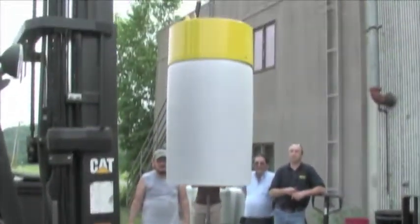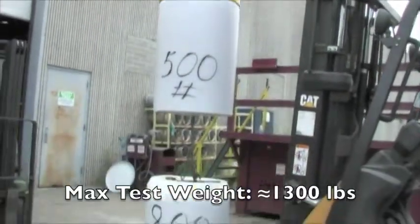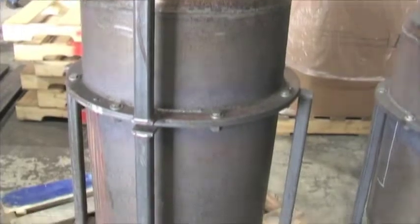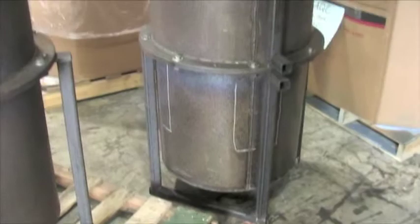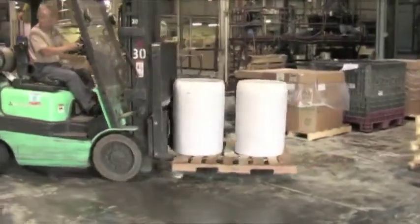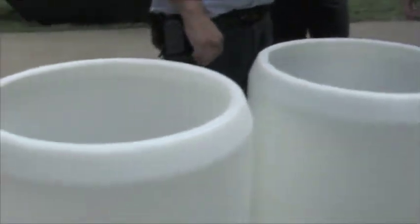In conclusion, we've completed all the testing and we're now prepared to deliver the product to the contractors for the Department of Energy. This particular liner is roto-molded — there's basically a hollow shell. We pull the top off, put in your dry resin, heat it up to somewhere around 500 degrees for about 18-19 minutes, and at the end pull the top off and then pull the insert out, leaving us with the desired thickness and weight to meet specifications.